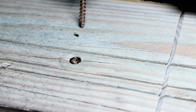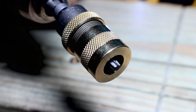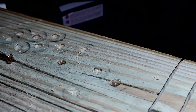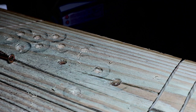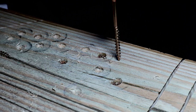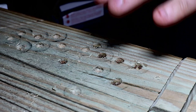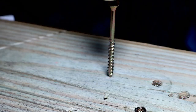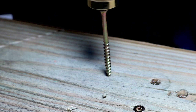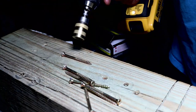Now if I wanted to drive in another screw to the exact depth, no issue there. What happens is the top of this actually stops the screw from going any further. If I wanted to drive that in about a quarter of an inch, I can bring that all the way down. The head of this adapter actually stops the screw from going down any further. If you do not want to go out and spend a lot of money on a different type of tool such as a drywall screw gun, this would actually allow you to hang drywall and put those screws in, sinking the depth perfectly every single time. The more expensive versions have a rubber gasket on top so you don't damage the drywall, but you can see on this one I am sinking these to the same exact depth every single time.